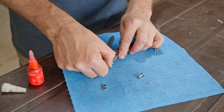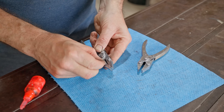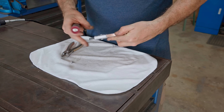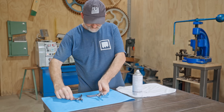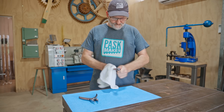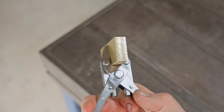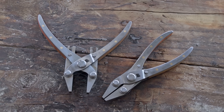That looks much better. Now I can put it together and I use thread locker to stop the nuts from coming undone. Using a Scotch-Brite wheel on the Dremel I gave it a final clean. I haven't gone crazy with a super high finish as I prefer more of a brushed look. To prevent it from rusting I'll spray it with Boeshield T9, which is excellent for this purpose — I sprayed plenty on and left it overnight to soak before wiping them down. Just a reminder, don't forget to check out the giveaway to win one of these pairs of pliers and the Kumiko kit. Here's the pliers in action holding the piece of brass that I showed at the start of the video. I reckon they came out amazing and it was an awesome project with lots of figuring out involved, which is what I enjoy. Hopefully you enjoyed the video — thanks for watching and I'll see you on the next one.